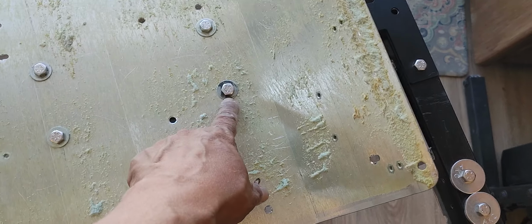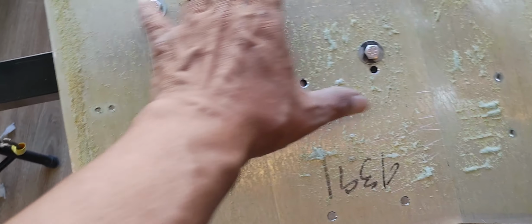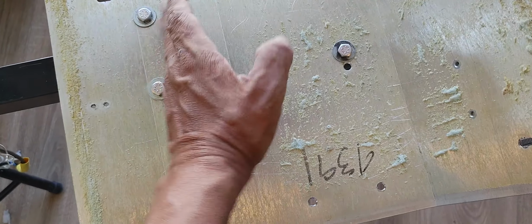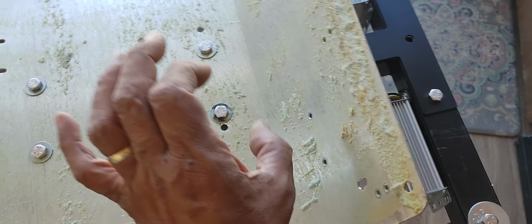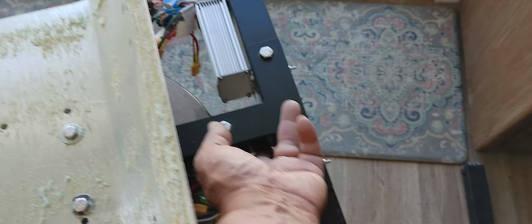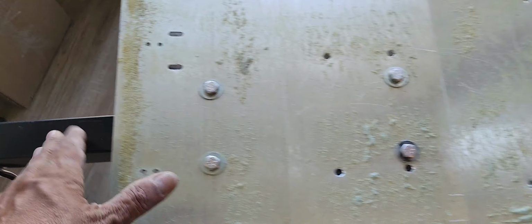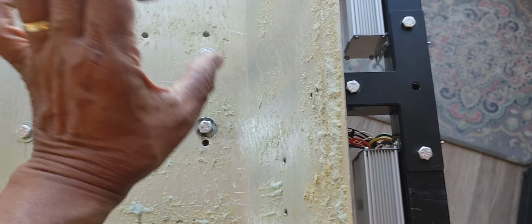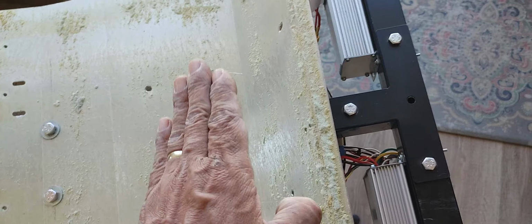The way the seat here is attached to individual pieces of this tubing, saddle mounted over the center here. And so if I put a pivot point right at the center of this seat, just raise it maybe another inch, I can put the shock absorbers. I'm going to have to manufacture some kind of a bracket that clamps from underneath the center section here, and just have two shock absorbers on the sides where the seat rides on top of them, and that way it'll give me cushion.